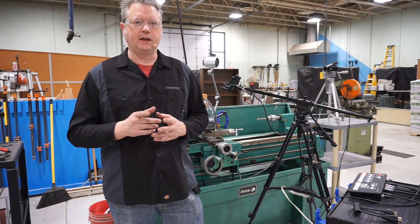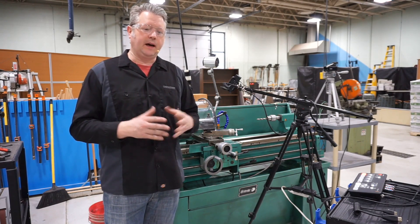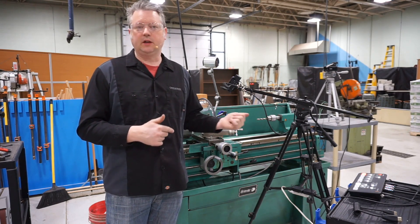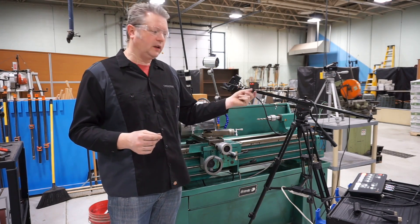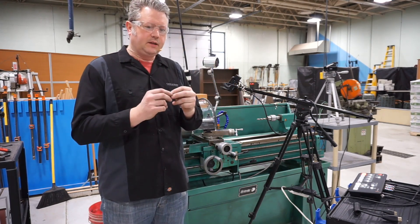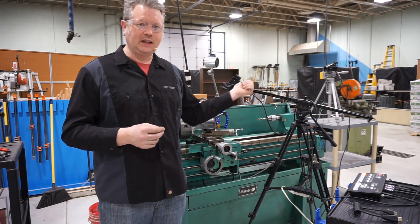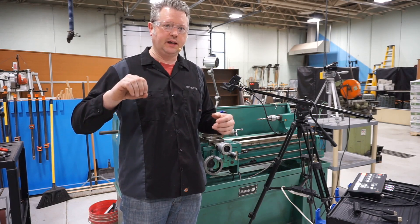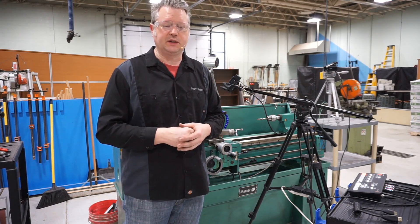Hey Mechatronics students, this is Andrew Donilon and in this video we're going to be back on the metal lathe, talking about how to turn a shaft down to a certain size. We've got some one-inch material already loaded up in the chuck. The end of it needs to be faced. We're going to drill a center drill in the end and use that beveled countersunk edge to capture it in the tailstock and support it on both ends. When you have longer shafts, you have to support it on both ends of the lathe. This is turning a shaft down to a specific size.